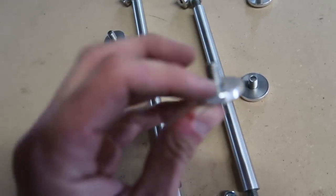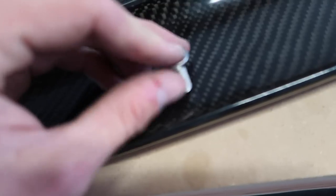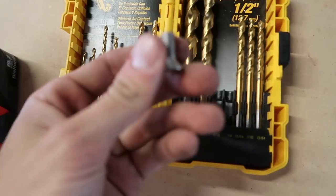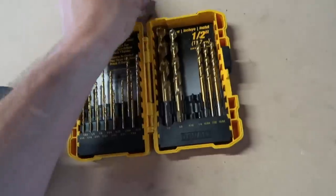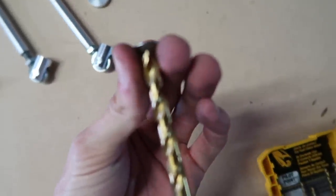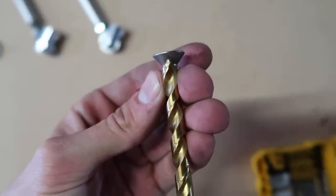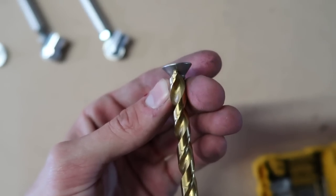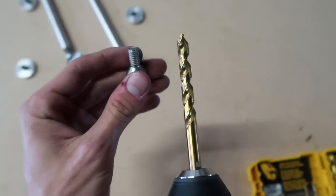We're gonna be using the hardware that the rods came with and they're actually quite girthy. Here are where those rods are gonna go in and we're not even close to getting that in — we definitely need to drill this a little bit larger before we proceed. When it comes to picking a drill bit size for the hardware you're using, what I typically do is grab the size I'm going to be using and square it up to the bits I'm choosing. As you put it behind, it's just slightly larger than the actual screw itself, and that makes sure it goes through simple and easy with no issue.